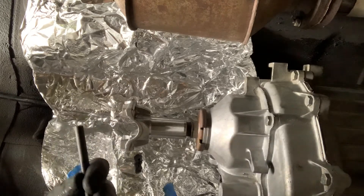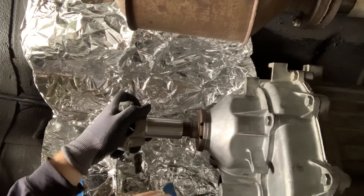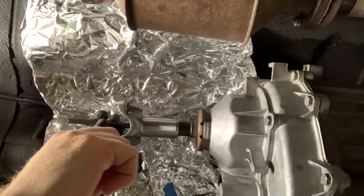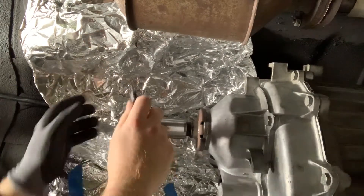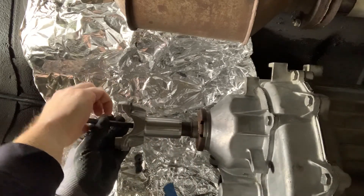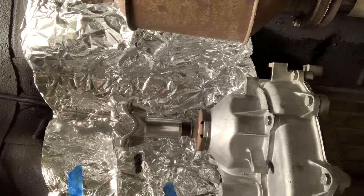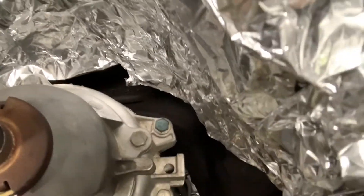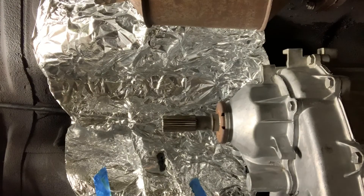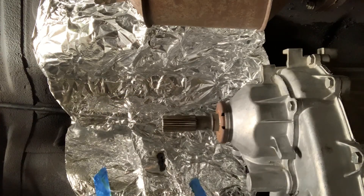Putting this up in there — I'll back it off a little bit so it can guide it a little more. Nice and tight. If you can see right there, I got a hole marked. Now I'm going to use a center drill to get that started a little bit easier, and then I'll come through with my pilot drill and drill that out.